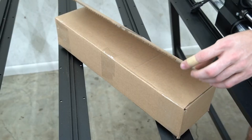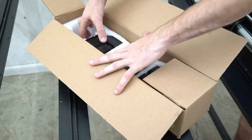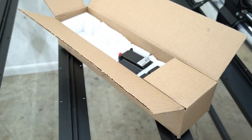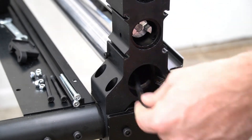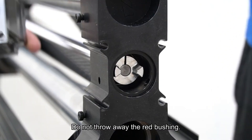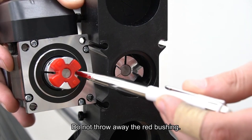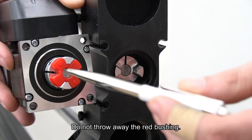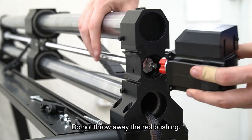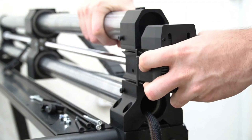From our electronics and accessories box, we're going to pull out the box with the three motors included. They are labeled on the bottom of each motor. We're going to use the X2 motor for the X-axis. On the end of the X-rail just below where we removed those bolts, we're going to pull the wire bundle out from the inner tube on the bottom. The three motors in the accessories box have a coupler with a red bushing on them, so that this bushing will line up with the existing other half of the coupler on the inside of the foot of the rail. We'll line those up then push the motor into place before securing it with our bolts.